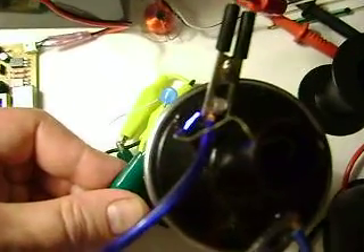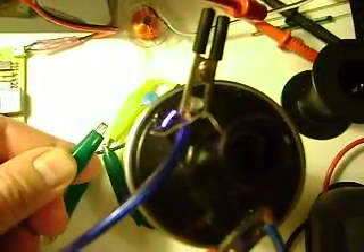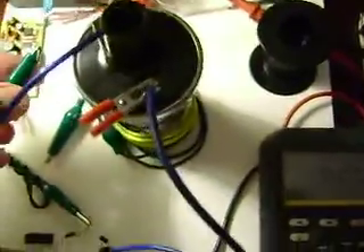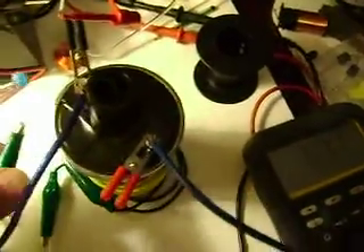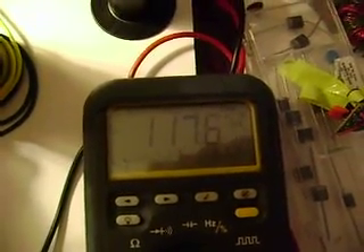Let's see our spark going off here. This is with the capacitor — a little bit lower frequency. Max power so far, without having the light bulb that goes with this transformer included in the circuit — we're just using capacitive. It's going to be whatever the capacitance is between this casing and any of these coils on here. 117 milliamps. And this board really doesn't even get warm at all still — not until we take it up to over half an amp draw. Looks good.